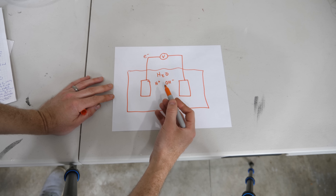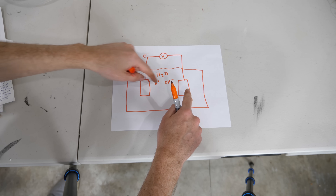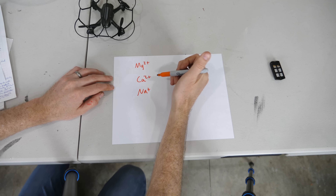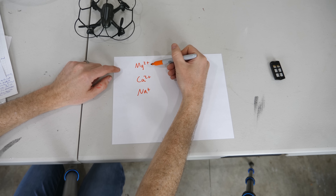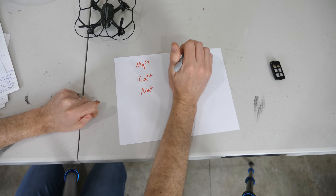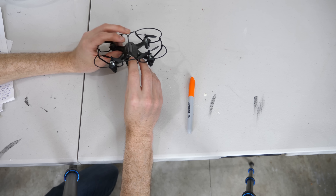If you didn't follow all of that, just remember this: pure water acts like an insulator instead of a conductor because it doesn't have enough ions in it, so it can't carry much current from one electrode to the other — you essentially have an open circuit. Even regular tap water that we sometimes call pure water actually isn't pure at all. Even bottled water has ions in it, so it can still conduct electricity due to magnesium, calcium, sodium, and other metal ions. If you just use regular tap water, you still won't see how much of an insulator pure water truly is.